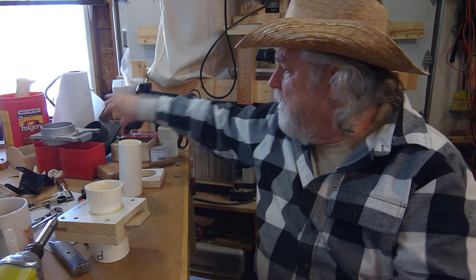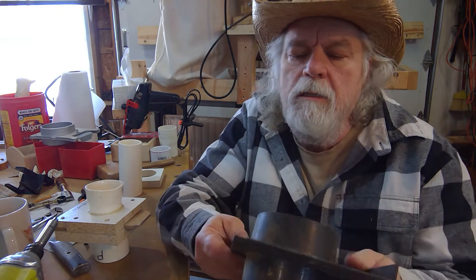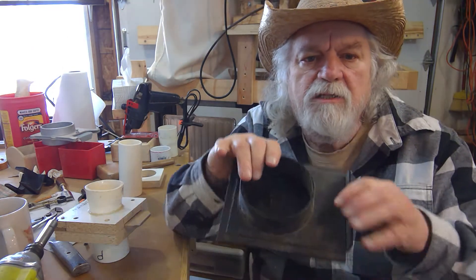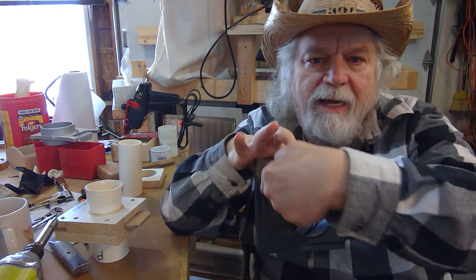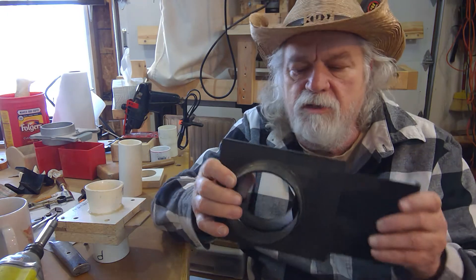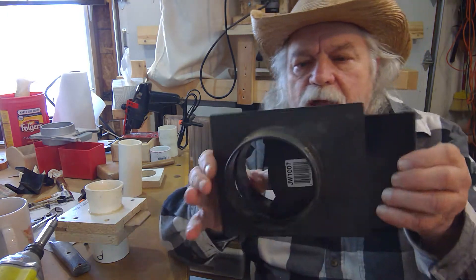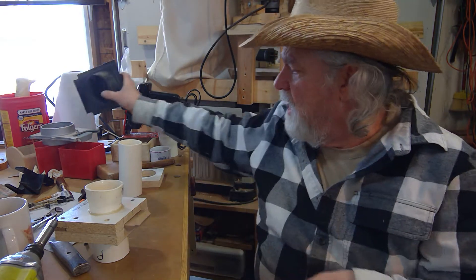I got talking about blast gates and dust collection, and I talked about a vacuum manifold recently. I was showing you a new idea about how I did the blast gates on the manifold so they could be cleaned out, because they're building up with dust. If you take a look at a standard blast gate — the commercial ones, the inexpensive ones — it's a dead end at one end of the slot. When you open and shut this, the gate piece goes into a dead-end area at the back, and this fills up with sawdust and fine dust over time, getting packed in there every time you open and close. Eventually the gate will not close — it'll stay partially open, and that's when you have a problem.